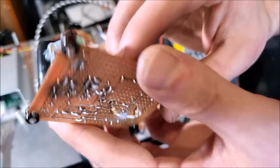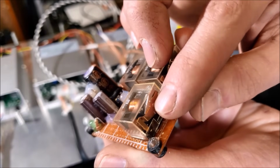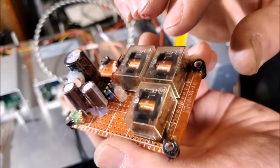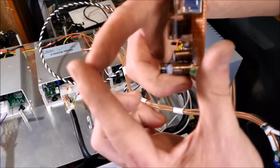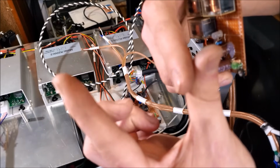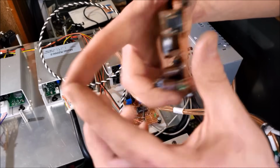And then the shared contactor pin, which is on this piece of metal here, is going to be our signal output. So between ground and our signal level, we'll be able to switch between no laser output, and then after about 40 seconds, laser output.